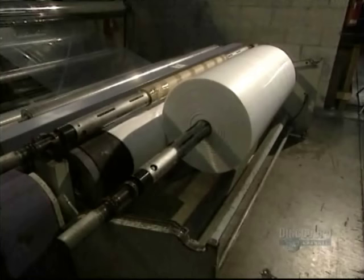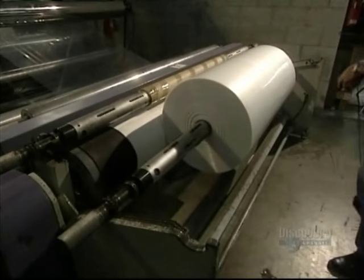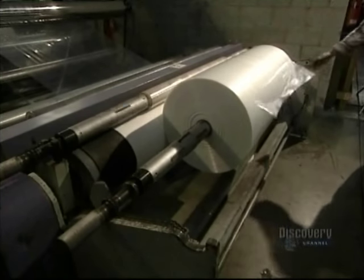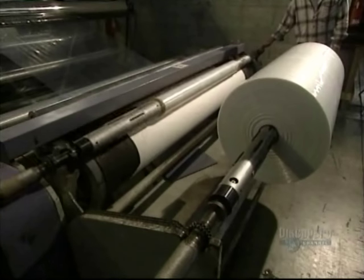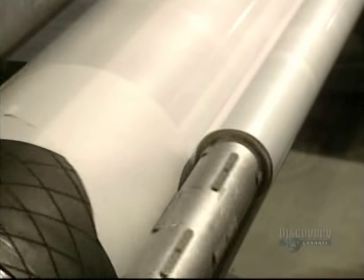The excess strip is salvaged in a tube. Several hundreds of meters of film are produced and rolled up. This particular roll contains the required quantity of film. When the roll is full, the film is cut. This roll moves forward and can be transported to another department, while an empty roll begins to fill up automatically. A full roll weighs 158 kilos and can produce 35,000 bags.